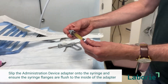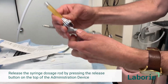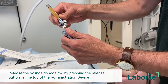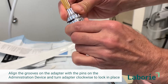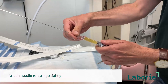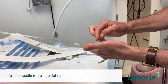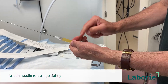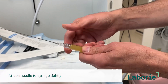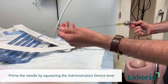Putting this all together: we go ahead and put the syringe through, we then let the back part press on this button, let that fall back, and we line up the dots with the opening there, put it in, and give it a twist so now it's in securely. Then we attach the needle — and it's important to attach the needle very tightly, because it's so viscous that if you don't attach it tightly, as you start to pump there's a lot of pressure and it'll actually start to work itself around the threads and come out if it's not done tightly. Then we prime it, giving it a few pushes till the material's at the end.